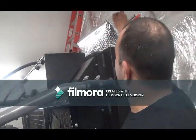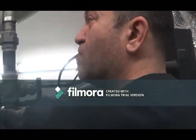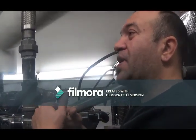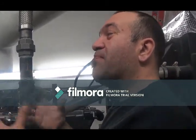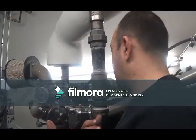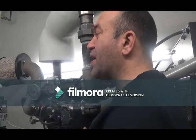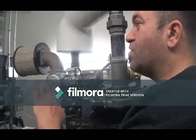These louvers, so you will see the top one there. These are temperature controlled. Even these ones, I see that you have temperature controlled. So don't be surprised sometimes if you come in here and it's really hot outside and then you see them crack open. They measure the temperature of the room and they'll adjust the temperature by opening and closing. So if it's too hot in here, they'll open up, allow some temperature to come in. Because again, even in the summer, you have the block heaters running, the engine gets warmed up. In the summertime, you might heat up depending on whether you have air conditioning in this room or not, right? So don't be alarmed by these things.